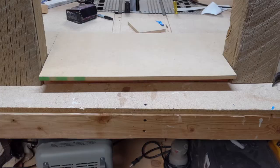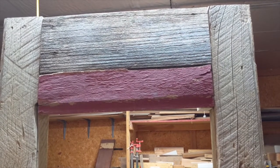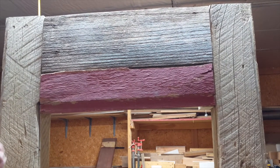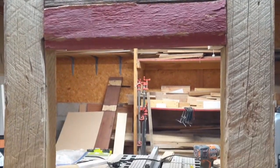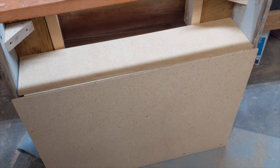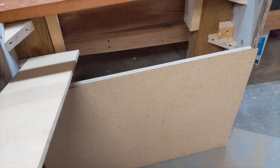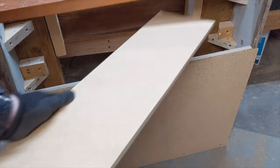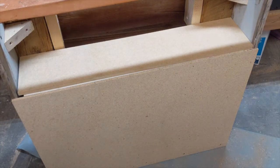Next we need to do the backing. I've put the face on — very simple. I basically just put a two by four on the inside and then nailed these boards on. Then I attached the back, screwed it down at the bottom into the two by four, and used brad nails on the sides. I'm creating a top to it instead of going all the way up, using two by four cleats — one along the back. This shell fits right in and kind of closes it in so the heat and light move forward.